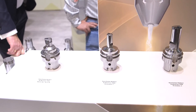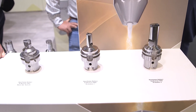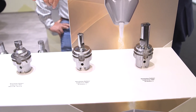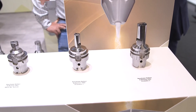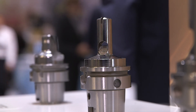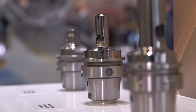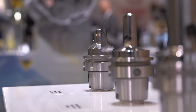On the top you can also see tools, especially reamers for chip evacuation. Our target was to achieve a 100% clean part, so we have a 360-degree closed coolant flute, meaning all chips come out the back of the tool and not into the part. In conventional machining it's not possible to produce a tool that is completely hollow inside — we use that space for the chips.